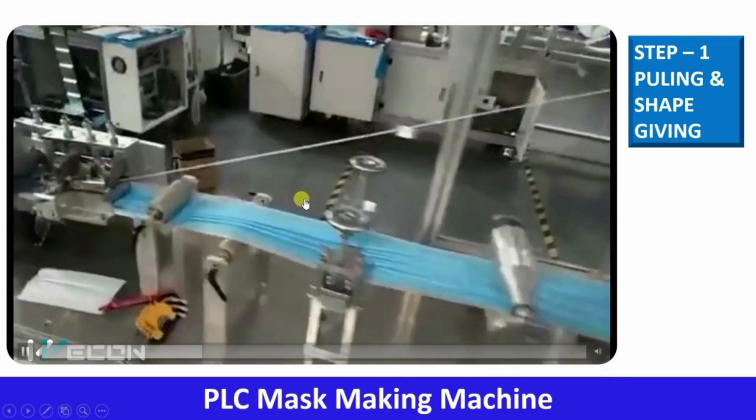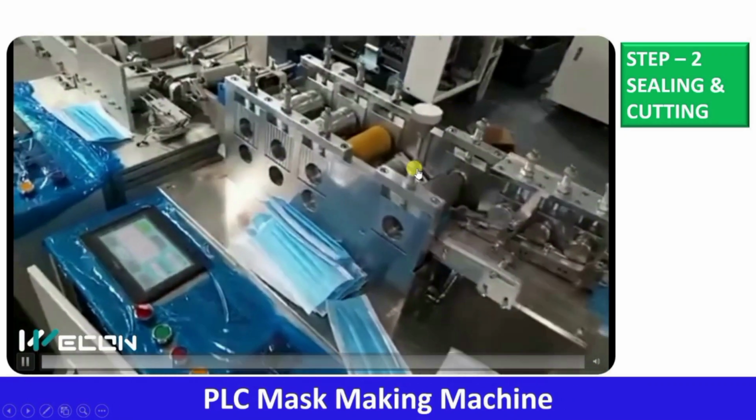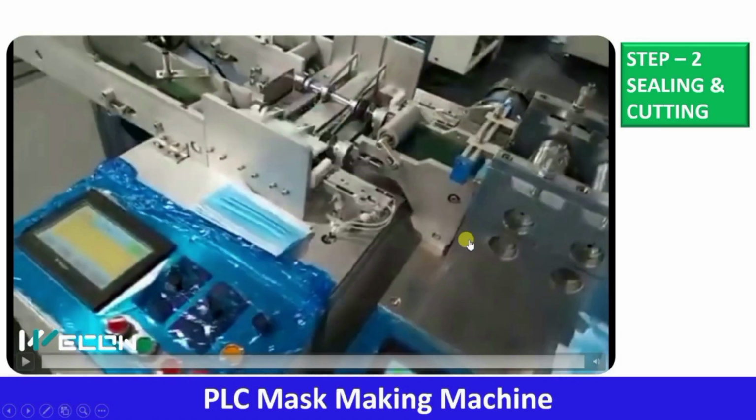What is the second step? Let's see the second step. So this is the machine. What it does, it seals the mask from all four sides, that is two horizontal and two vertical sides, and after that it cuts into uniform size. When the desired size is achieved, it is cutting through this cylinder, you can see. And here these are the chain drives. So this whole assembly is working through a motor. You can see these are the chain drives, and these rollers are pressing, hitting and sealing, and then cutting in uniform size. So this is the second step.